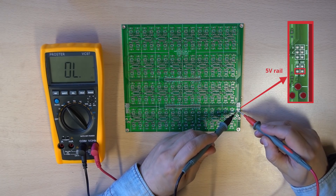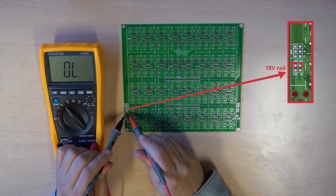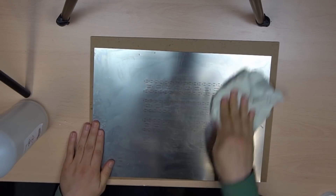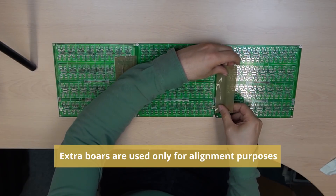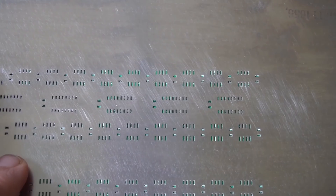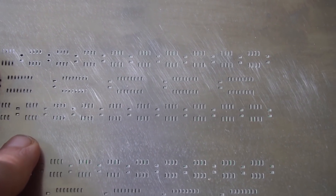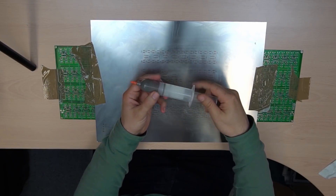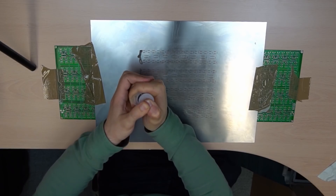Check that your PCB was manufactured without shortcuts in the 5V rail or in the 18V rail. Clean the stencil with isopropyl alcohol. Put other boards at the sides and tape them. Put the stencil on top and align it so that only metal parts are seen. Tape the stencil to the PCB. Apply solder paste and spread it with a single move using a razor or a card.